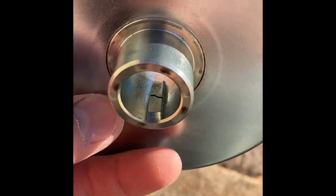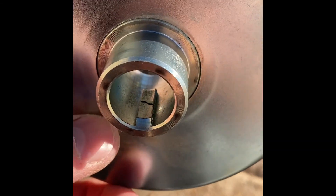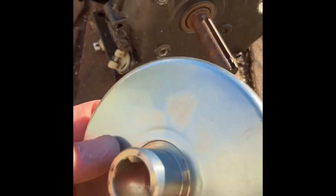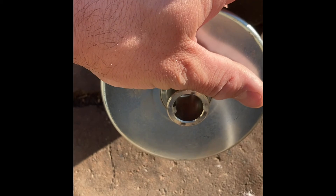This piece here — as you can see there's a little split in there. I need to try and knock out half of this. I'm making a torque converter work on one of these small guys, and as you can see that's not going to fit, so I have to put an adapter in between. The adapter needs to have a key, but one of these keys is just not long enough — it's not protruding past the adapter. So what I need to do is knock out some of that so I can put in a key here.